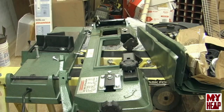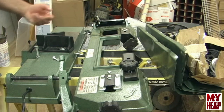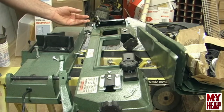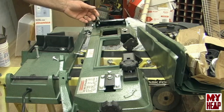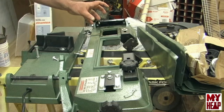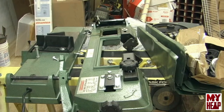I could cast another one, but I'd really need my milling machine — my little horizontal mill — which I haven't started on yet, in order to machine something I cast. So I think what I'm going to try to do, as a future video, is epoxy the pieces together and maybe run a bead of JB Weld around it to hold it, then bore it out and put a sleeve in to fix it that way. I'll go into that in the other video.